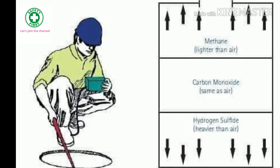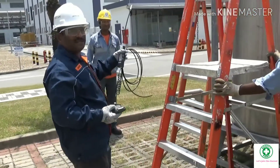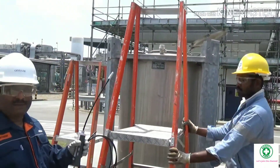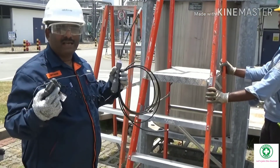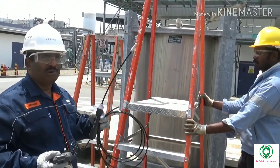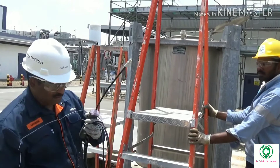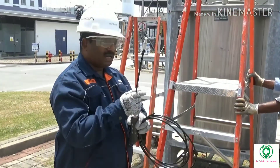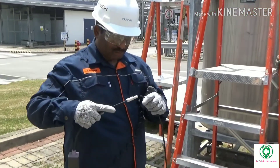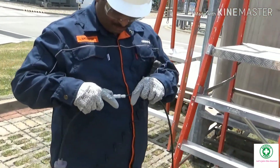This vessel is more than one meter height and less than three meter height, so I don't need to wear the harness. Also, this is not in a toxic environment so I don't need to wear the face mask. But since it's more than one meter, my pump cannot go inside, so I need to connect the extension to reach the tank bottom.